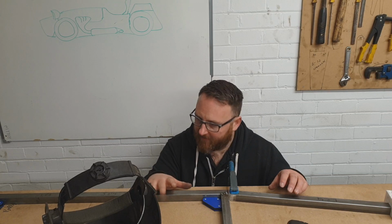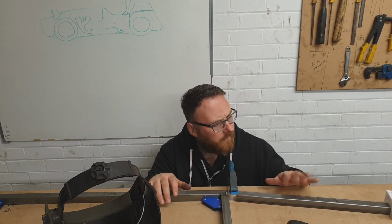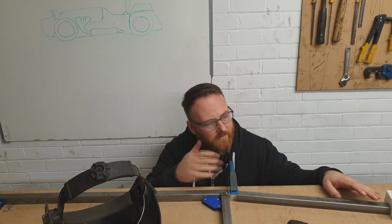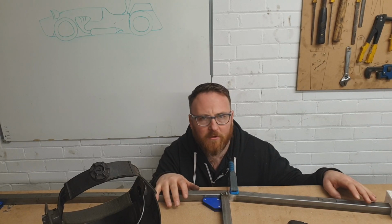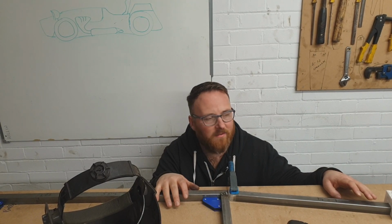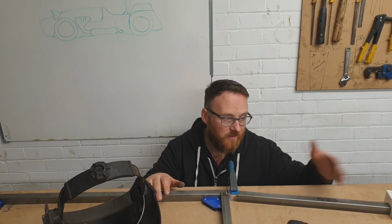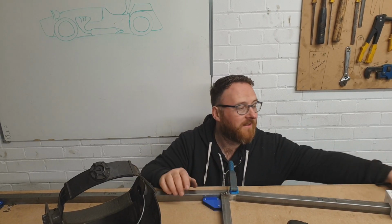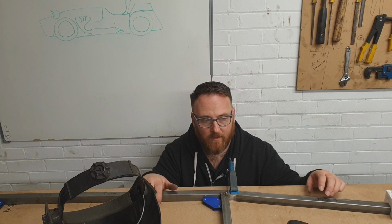Okay, we've welded up this and it's looking okay. Now we're going to start welding in these two slightly angled ones to the front. This is going to be possibly the trickiest part of the entire base, simply because these aren't tying into anything. As you'll see at the front where the engine and the gearbox part goes, it doesn't actually have a link bar that goes between it. So what we need to do here is measure from that far corner up to here, and then repeat the same on the other side, and just make sure that those measurements tie in, and hopefully that'll tack weld okay.